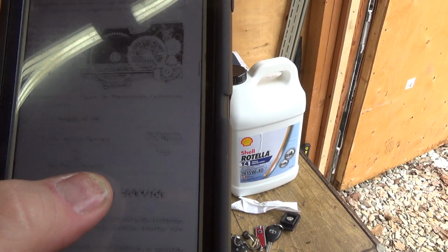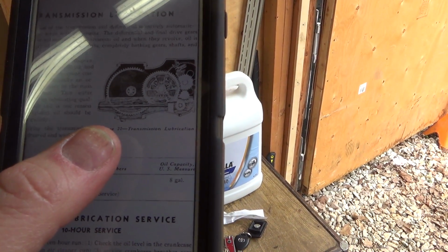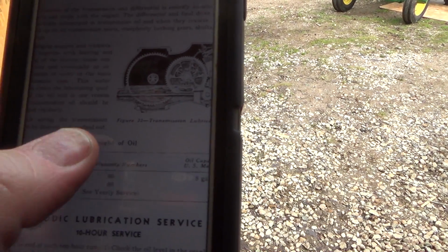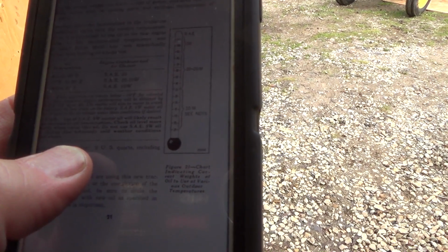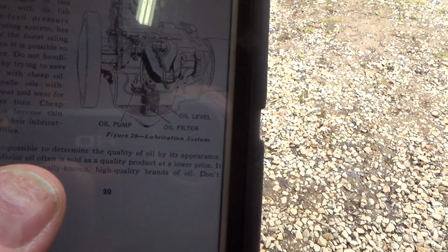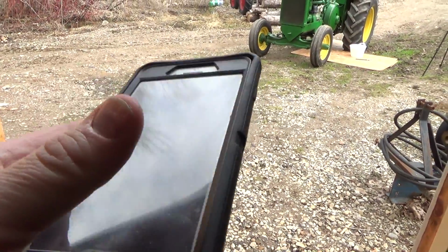It's not really showing me what, like, I know there's a drain plug for the rear end. It's a great big huge one. I'm going to have to use a 3/4 inch, I believe it is, ratchet extension square, which I do have, not up here, but they're showing you how much oil, 9 US quarts, and we've got a 1540, so we're kind of in the middle of everything. Should be alright. Give her a little bit extra lubey. And that's about it. There's a picture there of the oil drain and the filter stuff, I guess, and the oil pump. So it really doesn't hold that much because it's not splashed around, it's pumped around, right? So you really don't need like 15 liters of oil in it.